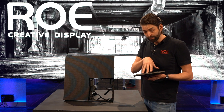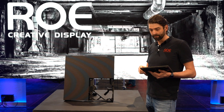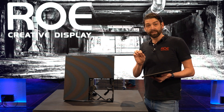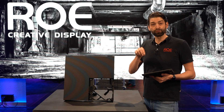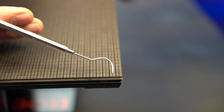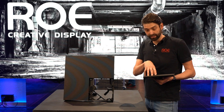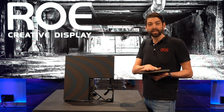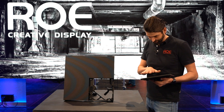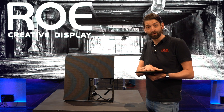If you look closer at the module, you will notice that the LEDs are in a bigger package. We combined four LEDs in one package. Why did we do this? Because if you combine these four LEDs in one package, it is stronger to mount on the PCB, especially on the corners where the most damage occurs. When you use a 4-in-1 LED package, as soon as you have some external force hitting the LED from the side, the PCB can handle the impact better. It is not a magical cure, but it will improve the lifetime of your modules.